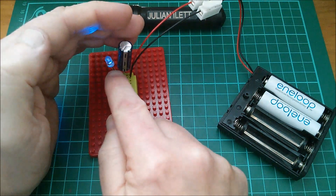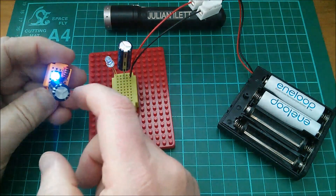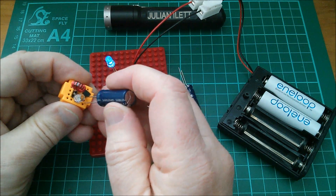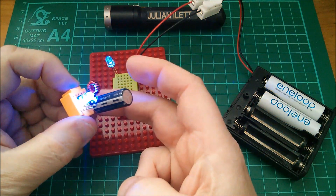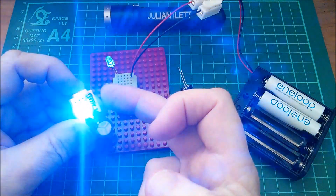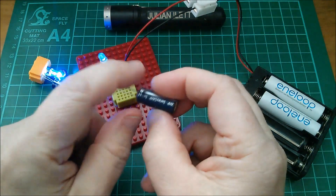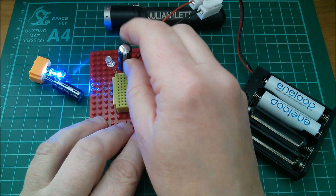For me this is good enough — when that light comes on I kind of know that this thing is going to be over about 2.2 volts, something like that — the threshold at which a blue LED just starts to glow. This one's getting a little bit low now, so let's take that one out. This one's mostly charged — let's put that one in my jewel thief. Oh yeah, that's really nice and bright, because the jewel thief is a boost converter effectively, boosting the capacitor voltage up easily enough to get a nice current flowing through that LED.